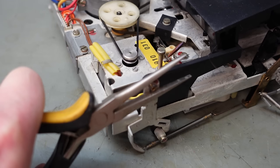They don't mention it, but they probably want me to take this off as well. It's got to measure the current to determine the torque. Now that's some very strange behaviour. I don't know if that's mechanical or electrical. But I do notice on this reel, it's constant torque on there, as this one keeps moving around. I'm going to put some probes back on the motor connections again.